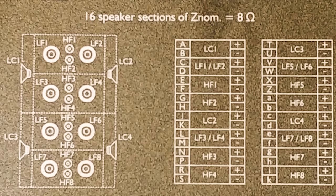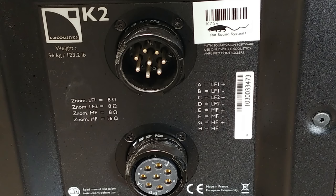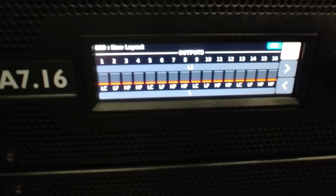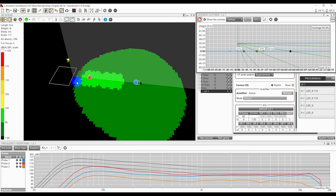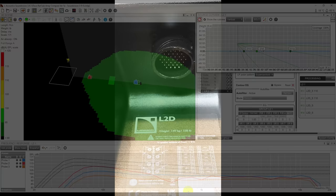The overall cable diameter is about the same, but there's only a single cable for the equivalent of four boxes, so you've reduced the number of connections compared to a K2 system or another system without as large a combined box. The amplifier puts out about 1,200 to 1,300 watts per channel into 8 ohms. There's some power sharing too — since the high frequencies don't use as much juice, the 12s and 10s can benefit from that. There's separate DSP so you can change the coverage of the enclosure and multiple enclosures in SoundVision while designing your array, to increase or decrease the vertical coverage.